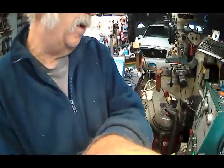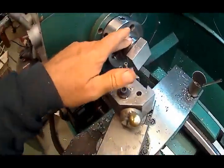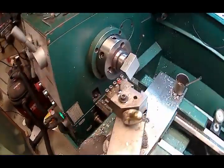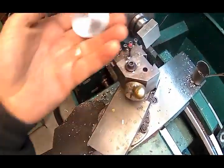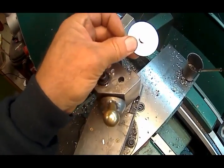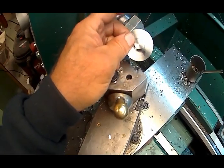I'm going to attempt the gears first. I didn't have any gear materials the right size, so I grabbed some aluminum blocks and I turned up a 1-inch spud on one side, and then I chucked them in the 5C collet here, and I'm turning the square diameter up to make basically, so this is the first one, this is the big one, there'll be 81 teeth on this gear,